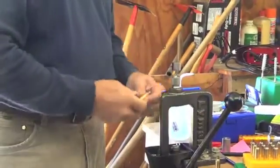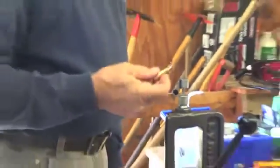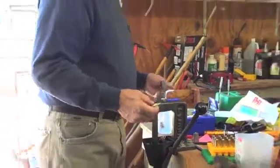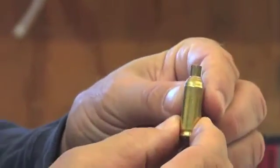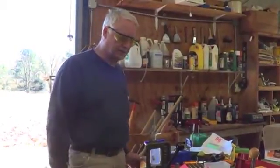That's what I do to form my cases. It forms a nice case. I had fire-formed some brass earlier and thought it was kind of short — I think I'm getting an extra ten thousandths at least out of doing it this way. I've done 96 pieces and you can see one here that actually split. It split on the four lighter blows, so obviously that piece had a defect. When I hit it that third time the ram just went in and the water squirted out. I lost one piece out of a hundred, so that's a pretty good percentage.